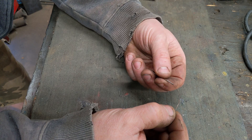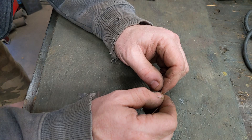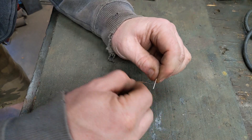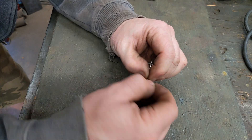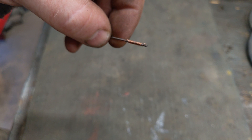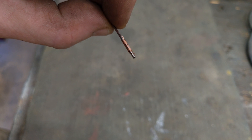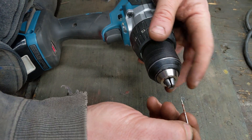Take the drill bit you want to use and just take one copper strand alongside it and wrap it around — that's it. You can bunch it up. A three-inch strand is about right; four inches is probably excessive for a tiny drill bit. Because the copper wraps around with consistent thickness, it won't be off-center — it's going to spin true.